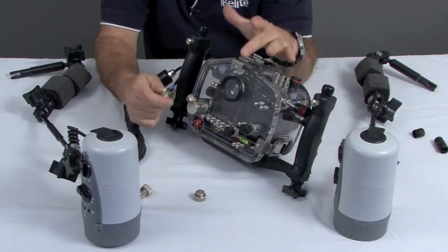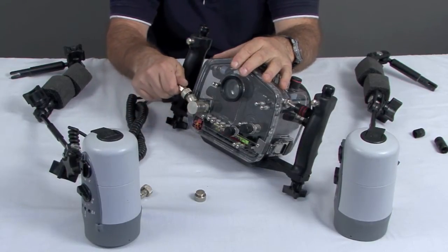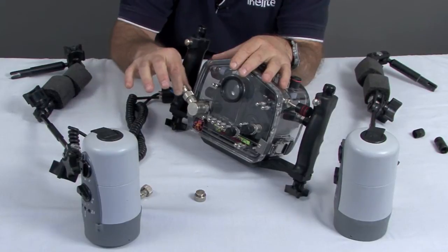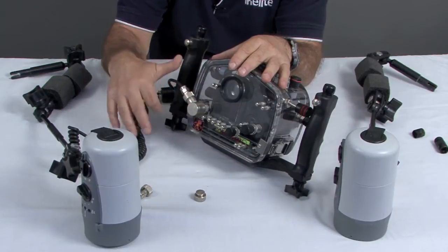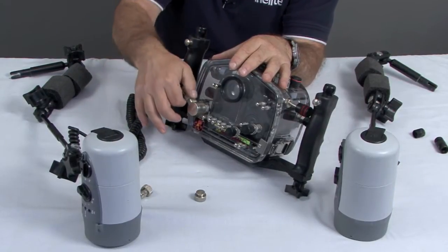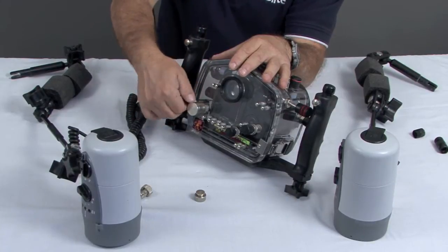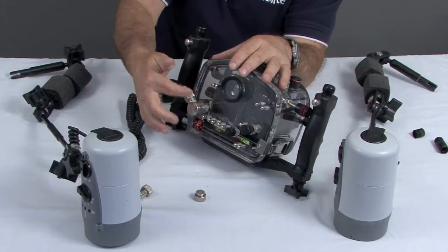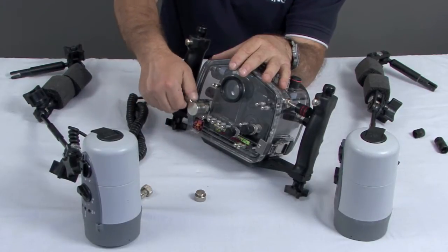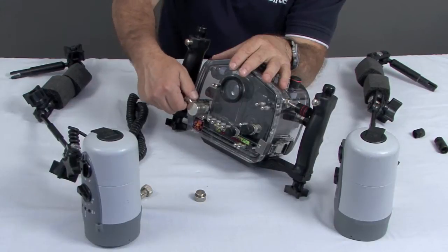You're going to see two pins and two adjacent holes inside the bulkhead that will match up. When this goes together, it goes together very much like a plug — you'll feel them seat into position. When you go to tighten this ring and snug this up, please remember: hand tight. You don't even have to go to the end of the thread. What the threads are doing is holding these two pieces in position. The O-ring has already long been in contact with its seating surface.